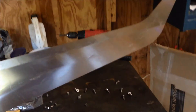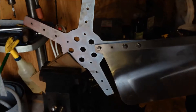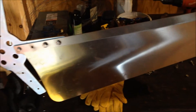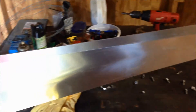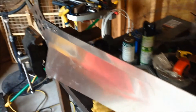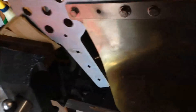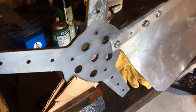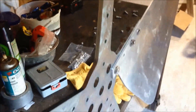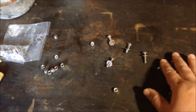Hello YouTubers, today is October 14th, 2014, and today I received my Super Falcon blades for my Freedom 2 PMG from Missouri Wind & Solar. They're pretty slick looking blades. Right now I just have one mounted on the hub. The hub is zinc plated, which is very nice — made out of 1/4 inch thick steel, no need to paint it. It also comes with stainless steel bolts to assemble with.